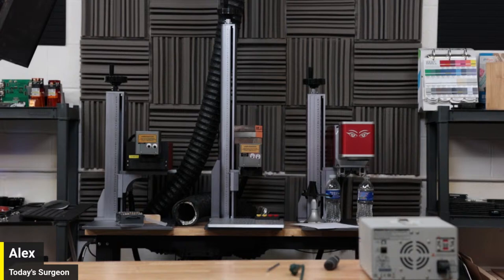It's just a reverse exhaust. Put another hole in your wall or ceiling and put a fan that sucks air from outside and blows it into your machine. Oh, what I want to do is just take the 4-inch that I have. What I want to get is a 6-inch inline for the galvos. And I want to take the 4-inch that's in here and put it in my attic and just have it exhaust out a stack when it hits a certain temperature.